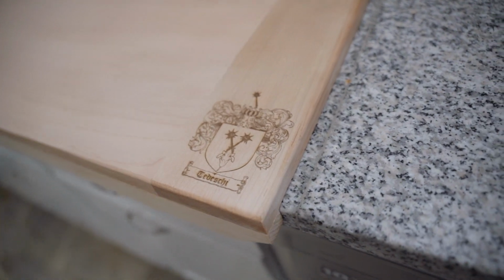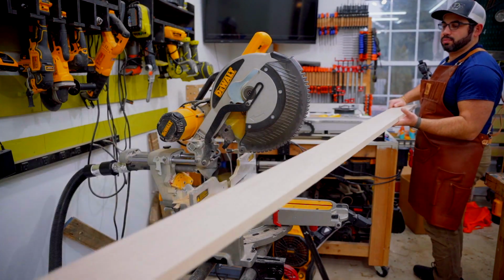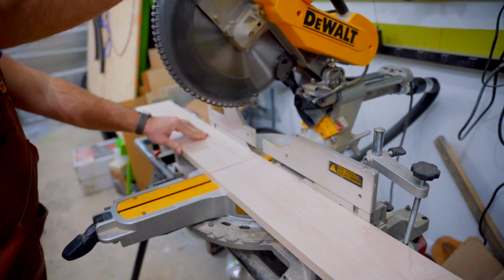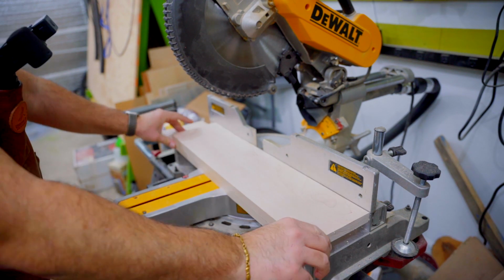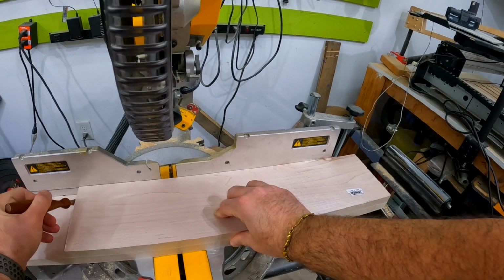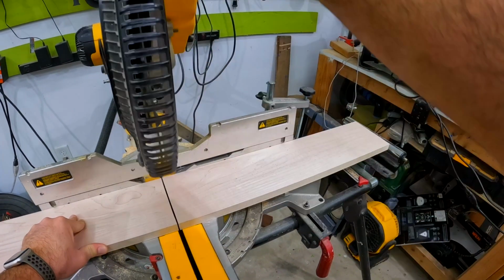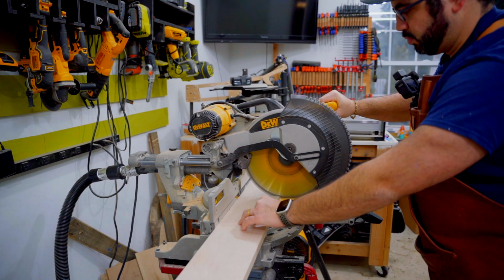To keep costs down, we're going to design this board around just one long piece of maple that you can grab from any local hardware store. The final dimensions of this pasta board will be 20 inches by 30 inches. So, to start, we only need two different lengths of wood to cut. 4 pieces of wood that will fit into the middle of the board, and then 2 that we'll cut later for the edges. For these middle boards, we will cut them down to 23 inches, since the width of these sideboards will end up being 3.5 inches each.